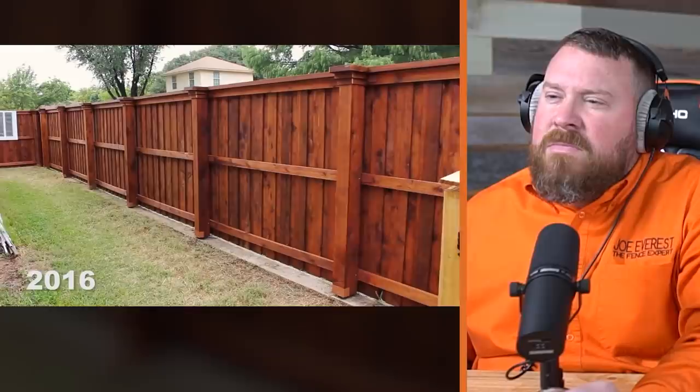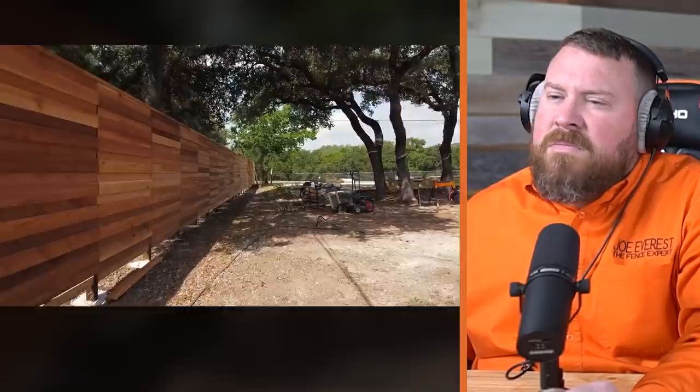Total, the fence is 196 feet long and ended up being 8 feet high. On my last board and board fence, I kept my existing post and just extended them to the height needed. However, since I'm going with a horizontal fence, I will need a post every 6 feet, which is the length of the pickets I bought. That meant I wasn't able to reuse the existing post.